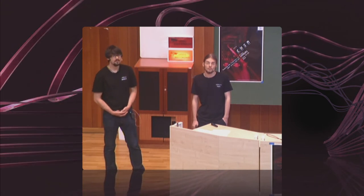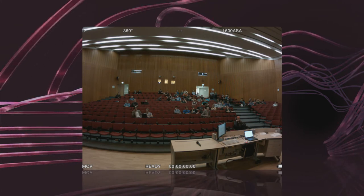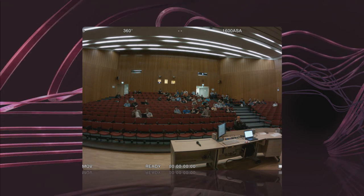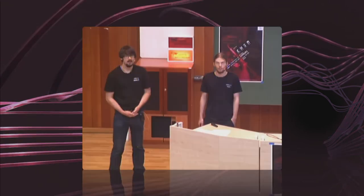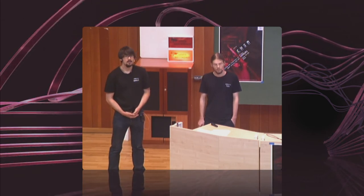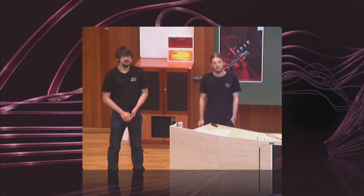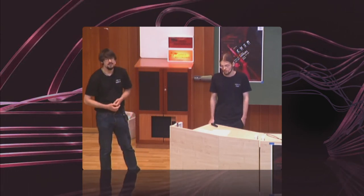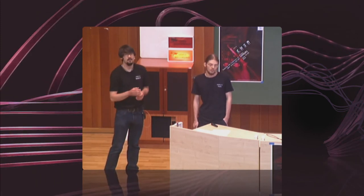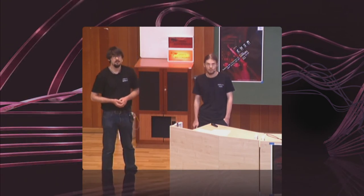The wavelength of the emitted light is truly UV, or? No, it is deep blue. You can see it very well. It's 445 nanometers, so it is at the frontier between deep blue and UV. If you look in the data sheet for the PCBs, however, you'll see that the response curve for the photoresists actually includes this region. So again, we wouldn't gain too much by using true UV.